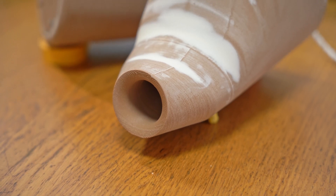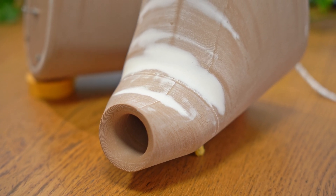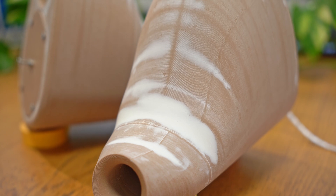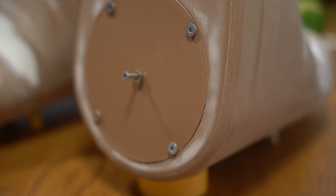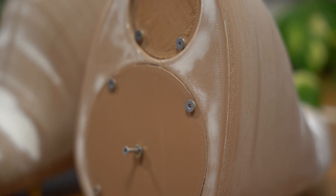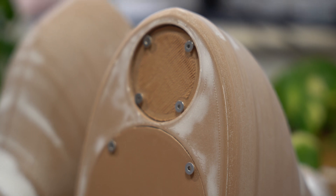Before we can move on to insert all of the parts, I would like to touch up the surface. I am going to be using some different sanding paper from very low-grit to high-grit, which will prepare the surface so that we can paint it more easily later on. This enclosure was printed on a 0.8mm nozzle, which is double the diameter of the default nozzle. Therefore, the grooves created through the printing process were quite noticeable, and it took a lot of sanding, filling, and sanding again to get a sufficiently smooth surface for the paint job. I decided to smooth the baffle as much as possible, but for the rest of the body, I left just enough roughness so the layer pattern is still visible, giving the speaker enclosure its own unique appearance.